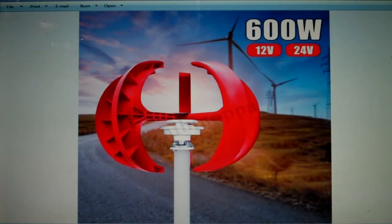You've got to realize one thing. With a horizontal wind turbine, as the wind comes through, it pushes right through the blades and just keeps on going. With these vertical axis wind turbines, it's pushing the blades on one side, but the other blade is coming towards the wind, so they'll never reach any kind of high RPMs, any way you set up the design.